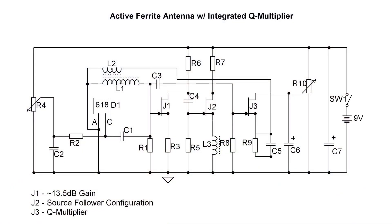You can download a copy of the schematic in the BOM — just go to the video description for a link to the Google Drive. J1 is configured as an amplifier, designed to keep the gain less than 15dB to reduce oscillations. There's no bypass cap in parallel with R3. A different JFET other than the MPF102 may require a capacitor there, around 0.01 or 0.1 microfarads.